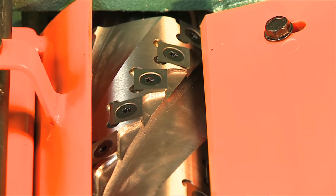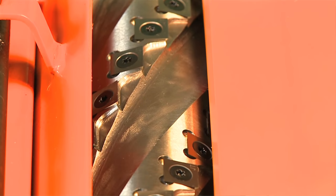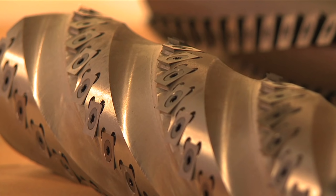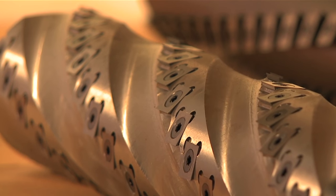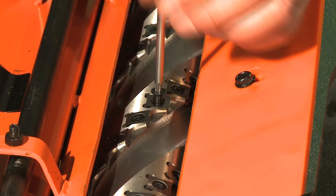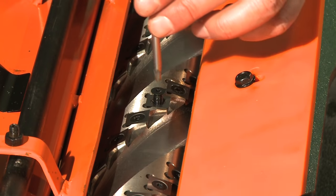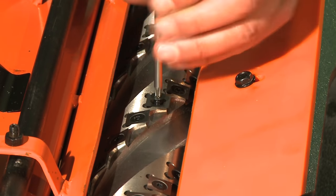The cutter head is 3-1/8 inch in diameter and uses 98 solid carbide inserts arranged in four spiral rows. Each insert has four separate cutting edges, allowing the user to quickly replace a nicked cutter simply by loosening and turning the individual cutter 90 degrees. Not all the inserts need to be changed at the same time — if you plane a lot of narrow stock and the cutters go dull in one area, you only need to rotate those few inserts.